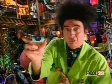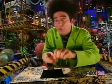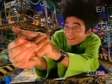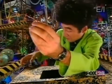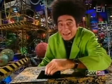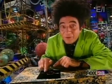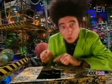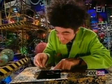Now, here's the tricky part. Our wire is covered with stuff called enamel. It doesn't conduct electricity. So, take your sandpaper and sand all the enamel off one end. Then, lay the coil flat on your table and sand off only the top half of the enamel on the other end of the wire so that one side of it has enamel and the other doesn't.